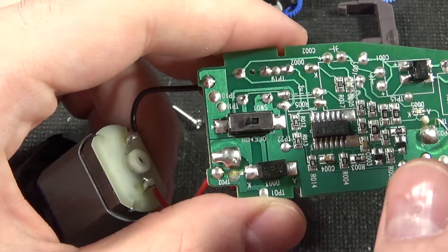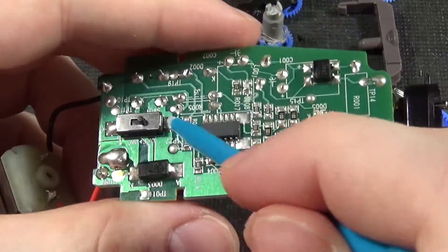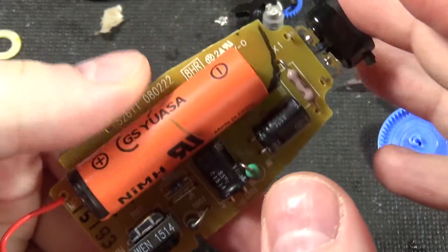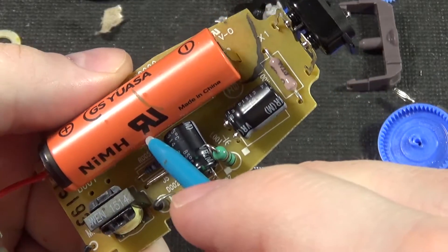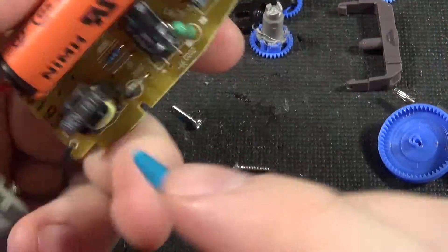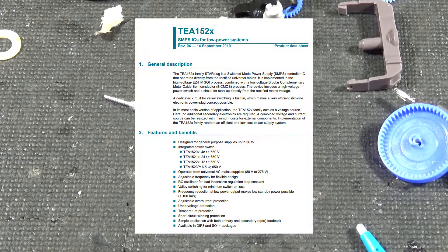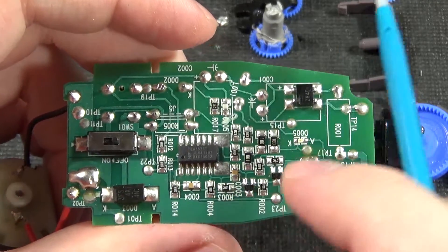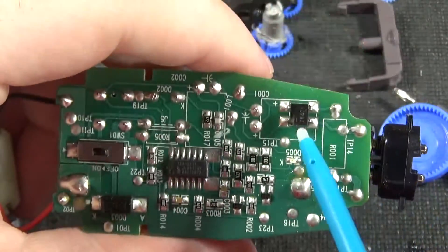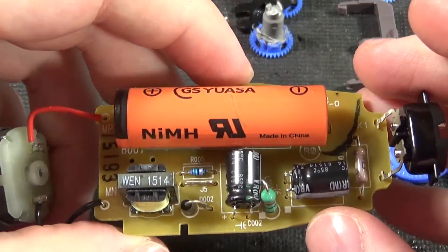By flipping that up, it turns it on. It's possible I'm missing a track or two under the switch rather than the structural support pieces. It may or may not check the battery, although nickel metal hydrides are not like lithium — it's not going to matter as much if you run it dead. The charge circuitry — we'll have to check out what circuit is on here. This is a NXP TEA1521T. There are all kinds of test points around here to play with. The silkscreen is pretty much all the way marked — they actually mark what's on the other side in general cases, which is quite nice. Very good silkscreening job, with lovely through-hole parts on top.